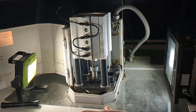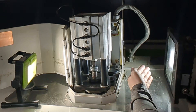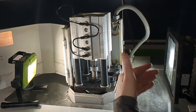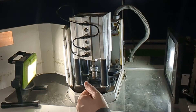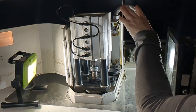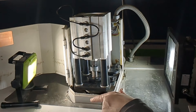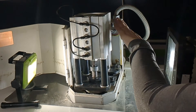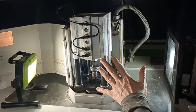The spindle door is open. A couple things I want you to take note of: there's a little limit switch up here — that's the enclosure door switch. When the door is closed it connects so that the spindle doesn't accidentally turn on when you have it open. I have a plate here because I actually bent my door a while back and was being lazy, so it doesn't always connect. When the spindle is moving it can shake the door loose and break the connection, and the spindle will turn off. Good troubleshooting hint: if your spindle is intermittently turning on and off, always double-check that you have good connection between the door and that switch.